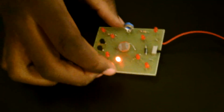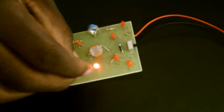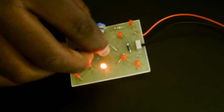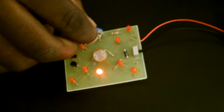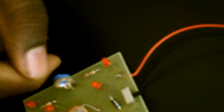Today, I built a laser light sensor. This is the photoresistor, and these are the LED lights. The transistors are what the photoresistors send signals to, to turn the LED lights on and off when light comes in. And this is the sensitivity — this controls sensitivity.